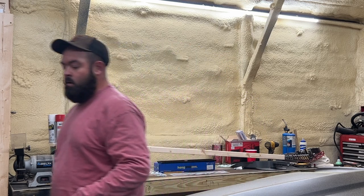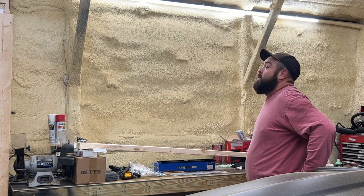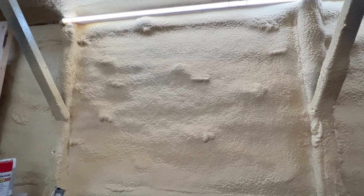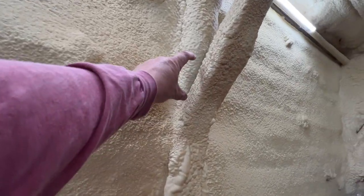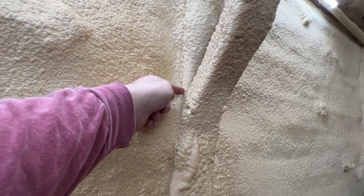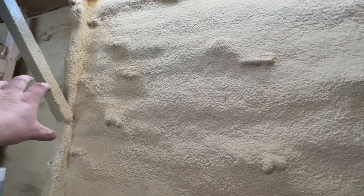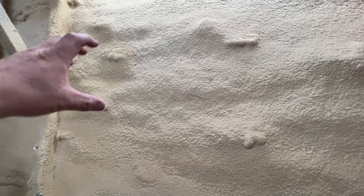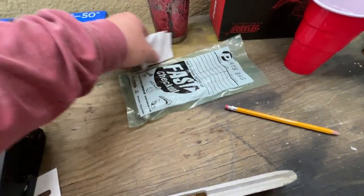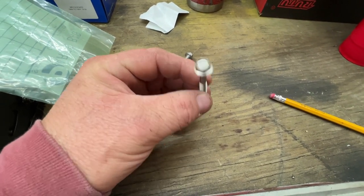I do know one thing — I've got to turn this heater off because it's getting toasty in here. I've been measuring and measuring a whole bunch. And this ain't no custom house, this is just a workshop — I just need to mount it. So I'm going to come in here and cut some foam away so I can flush mount it against that piece of metal. We're going to drop this two by four as low as we can down against this angle on both sides. Once we get the insulation cut away, we'll put the two by four in and try to level it up as best we can. For screws, I've got some three inch stainless self-tappers with a cap head — that'll be plenty for the two by four, and that TV doesn't weigh very much.